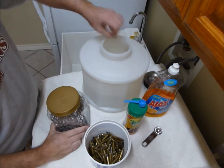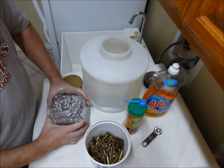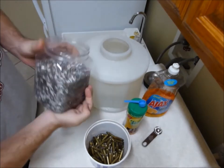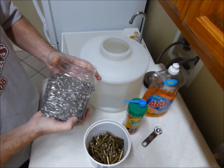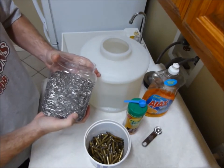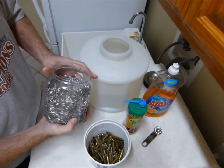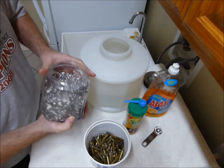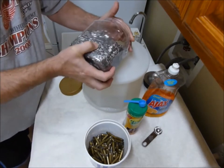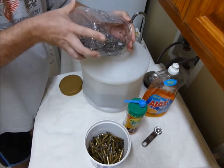I've got just lukewarm water in there. So what I'm going to do now is dump my pins. These are Ultra 47 stainless steel pins, and there's twelve and a half pounds. These pins are forty-seven thousandths in diameter and they're just a little over a quarter inch long. So I'm going to add the pins to the water.